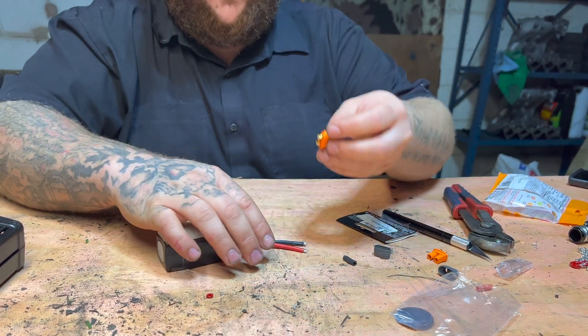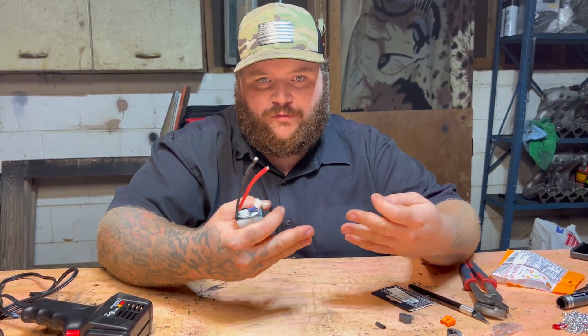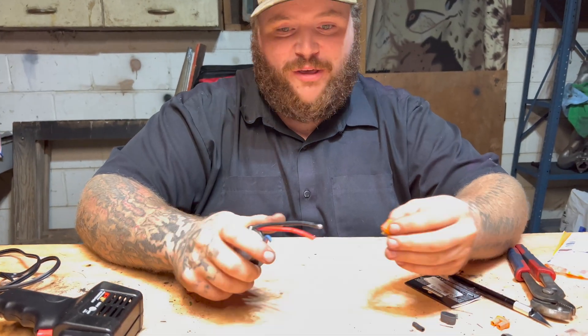Make sure you get the proper female or male connectors for batteries, because it's gonna plug into your ESC — electronic speed control — which controls everything; it's the heart of the RC. If you get the wrong connectors, you'll end up with two females or two males. You have to have one male and one female, so just don't get them confused.